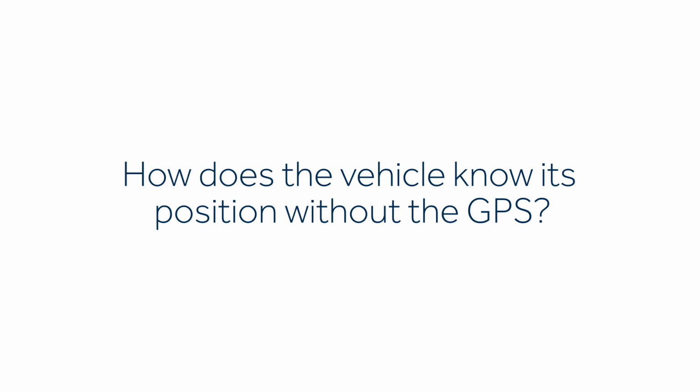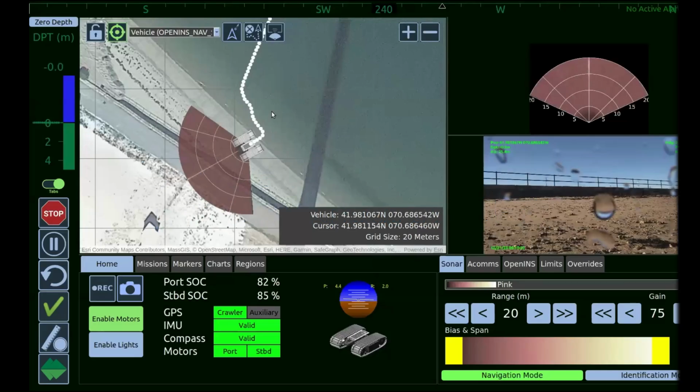As we drive along the beach, we have a GPS fix, and the software will use that as your navigational true position. As you go underwater and get subsea, the software will actually switch over to the inertial navigation system, using sensory feedbacks for navigational accuracy. Because we are an amphibious vehicle, we're constantly jumping between GPS fixes and inertial navigation solutions. That's how we handle our navigation, and we do a lot of testing to prove out that the subsea navigation is as accurate as we need it and want it to be.